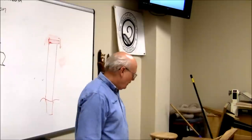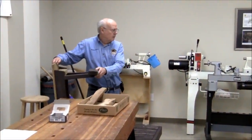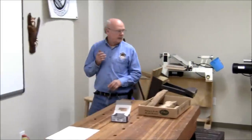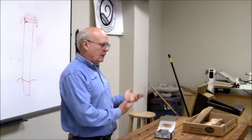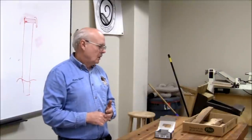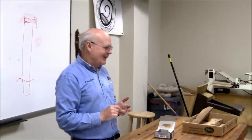Minimize ground contact — it will accelerate any deterioration of the wood. I have it sitting on a concrete patio now, which is a better environment. Even if you want to set it out in the yard, put a brick or something underneath it so it's not directly in contact with the ground. Whatever spacer you use should be corrosion-resistant.